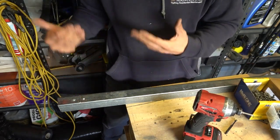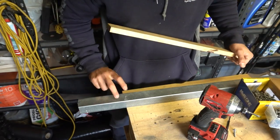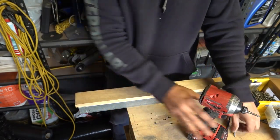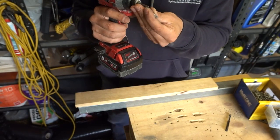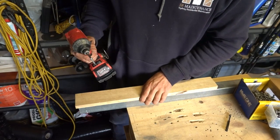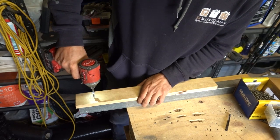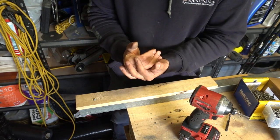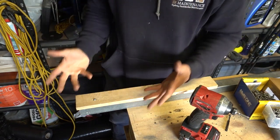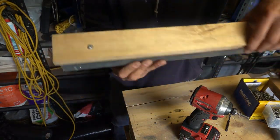Now let's try it with some timber and metal together. We've got a piece of hardwood with a steel post on top. We'll try the dome head, contour, or wafer head first, then switch to a countersunk head. You could feel it when it got to the second piece of material and then it just automatically went straight through. That one there is nicely held in with one screw.